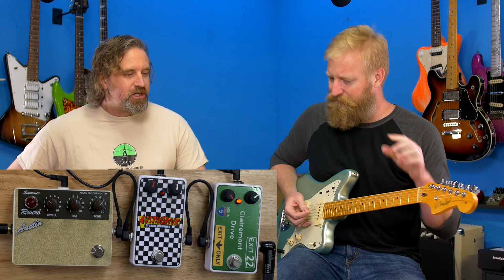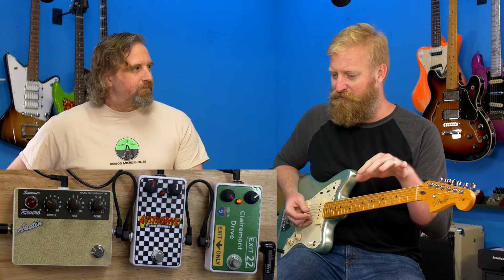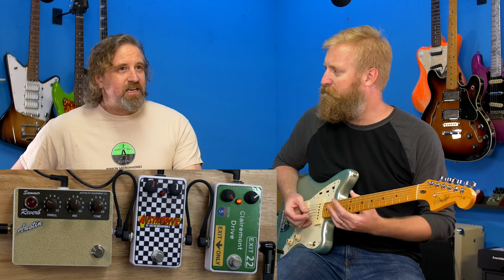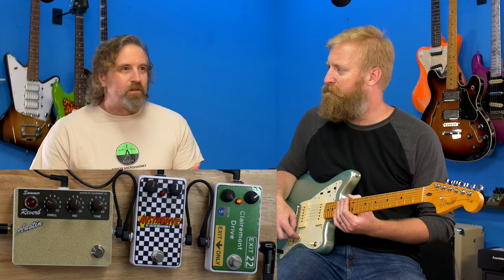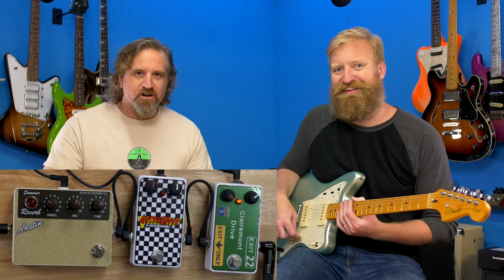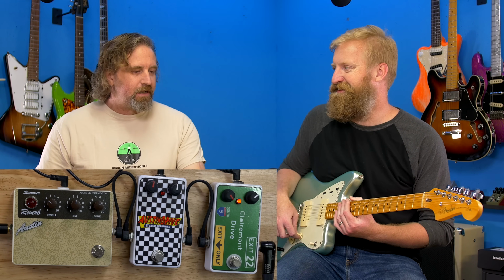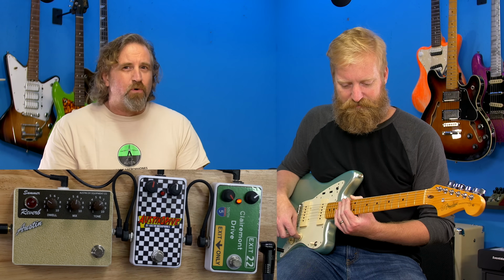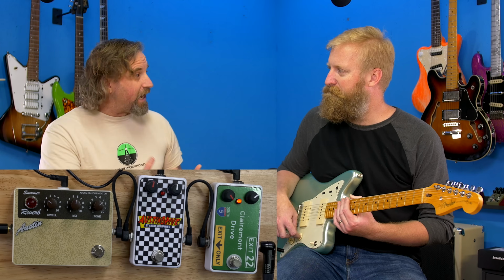Yeah, very mid-rangey tone on this. I'm hearing the fuzz element you're talking about. Yeah. So I think on this one I'm using 914 diodes, which is a glass diode, one of the first diodes that was actually made. Cat's whisker, if you're an engineer nerd, you know what that is. And then the next one I think has silicone 1N4004 diode, clipping diodes, and there's 2 stages of clipping actually.